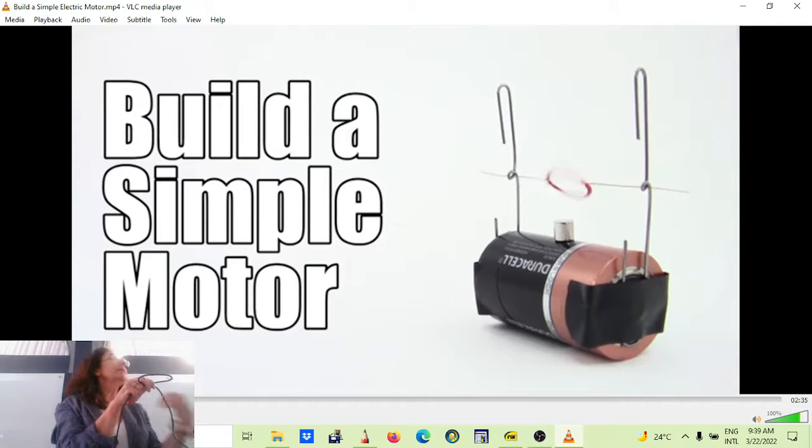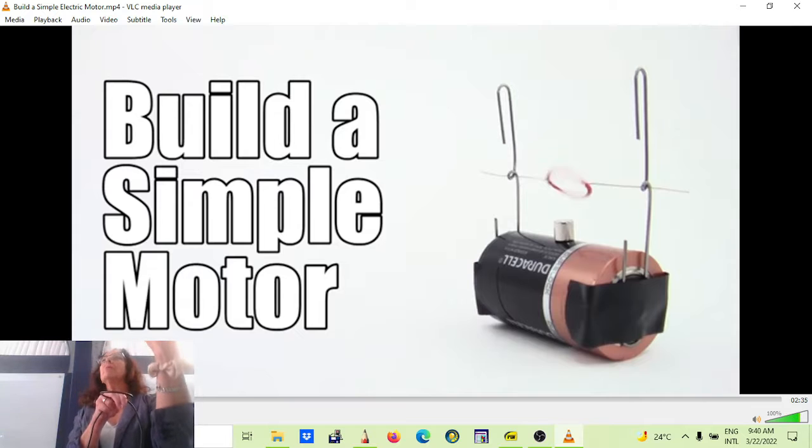And last time in class, I showed you mine. You can do it very easily with a screwdriver. You take a screwdriver, the tip will be the core of your electromagnet. You go around, so you will magnetize the core, the screwdriver, which is made of steel. You bring all the magnetic field inside, so it makes the magnet stronger. And if the current flows in this direction, that will be the north. So again, if you have a loop of current, you look at the direction of the current, you wrap around, and your thumb will give you the north, and that will be the south.